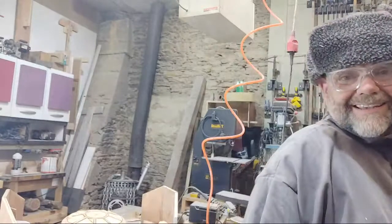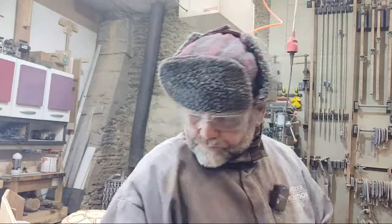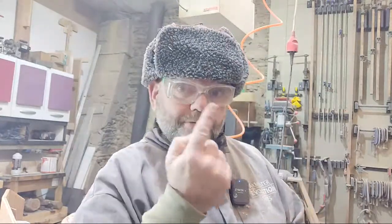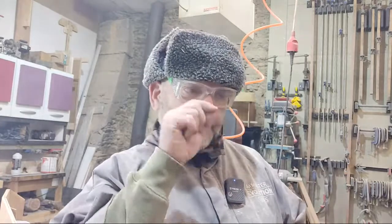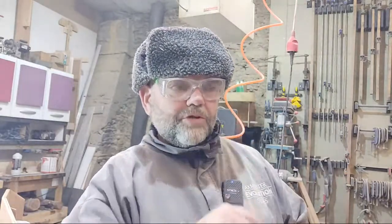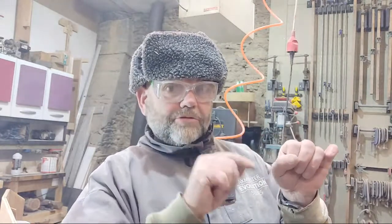A pillar drill or a router would be very handy, but you haven't got to. There are other ways. You can actually cut the little half round dots into each dice quite easily. Then you can put a little dollop of paint in each one, or just spray the whole thing, and then sand it flat again, and that'll leave black dots. Or red dots, whatever colour dots you like. That's kind of how I do my signs, whenever I want the letters to be black, for instance.